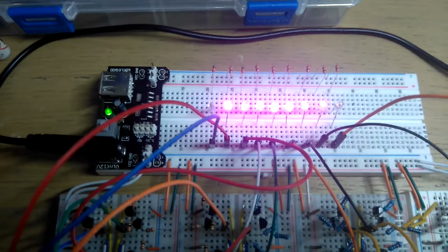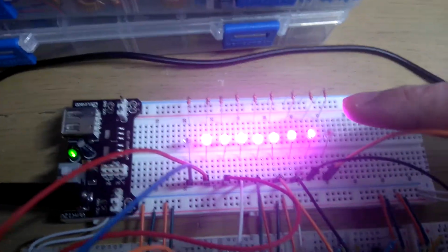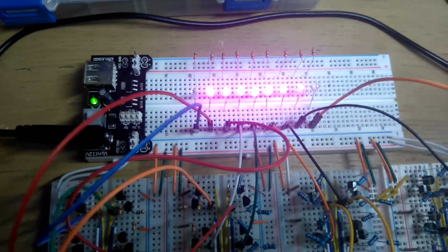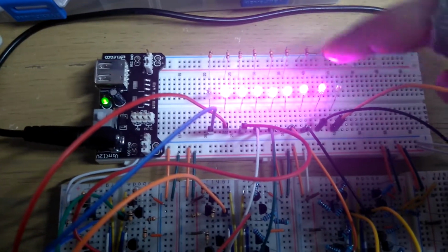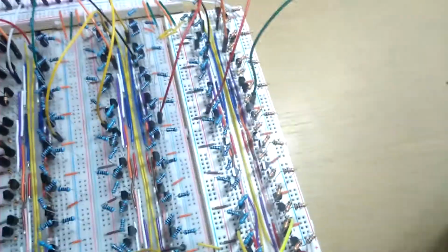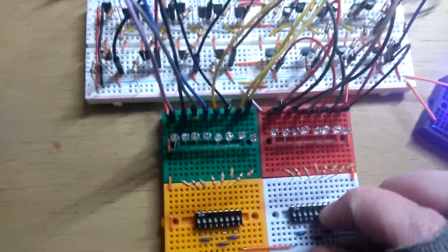So remember, when you have inverted all your inputs and added 1, you have to imagine that that's got 1 added to it, if that makes sense. Or, because it's negated, it might be minus 1. But basically, if you added 1 to this, like assume, off is what we want, that would actually be over there and be 2. If that makes sense. It's hard to tell, right? Because when you have subtraction on, you also add 1. This is the carry in. So you've added 1, and yeah, that's minus 2. Don't ask me to explain it any more than that, because I'm not that clever.